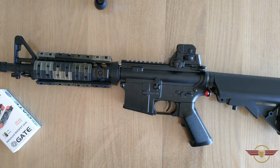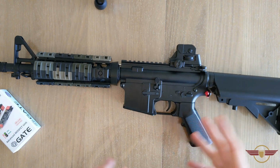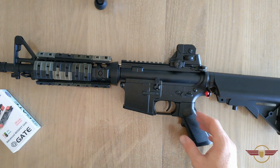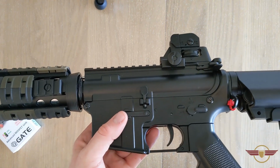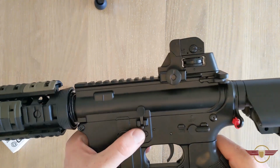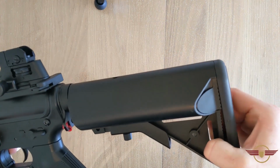We then took it to site. My son went to use it because this is primarily for my son, and it just kept locking up. The chip wasn't working properly, all sorts of things. So I stripped it all out and stripped it down, and first thing I realised is where the motor goes into the bottom of the gearbox, the top of the gear on the top of the motor had chewed through the wire, so the wires themselves were exposed, which kept causing shorting issues, which obviously is an issue straight away.